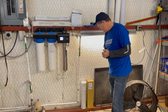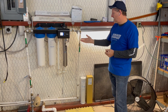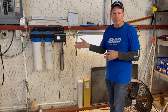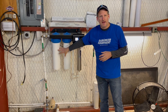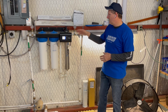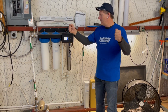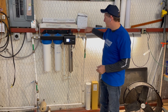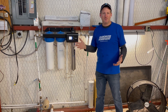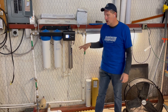This is a 16 to 20 gallon per minute system. These come in all different sizes — you can get them with filter housings and cartridges or without and do them separately. These wall mount manifolds make it easy: you mount it to the wall, plug in one side and out the other, which saves a lot of extra labor. But if you prefer, you can buy all the components individually and install them separately.